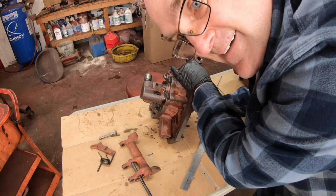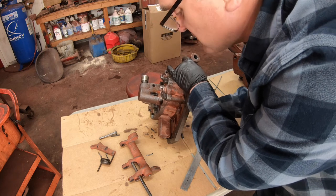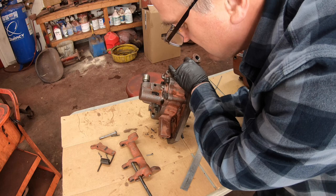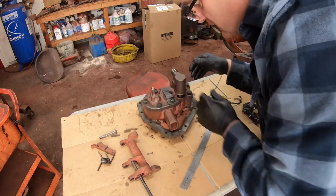That's the sound of a tight pump that's going to prime itself easily. That's one of the reasons you're liberal with the oil — so it primes easily on first startup. The oil level on this pump runs right about here in the reservoir, so not quite enough to immerse the gears in oil.